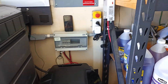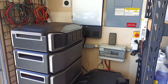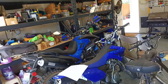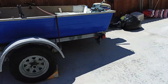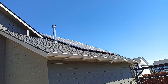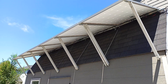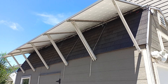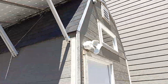The other question was how do I have these hooked up between multiple DPUs. I have my main array for four kilowatts — it has eight 475-watt panels up on the roof. That's my high voltage input for my first DPU. And here on the shed is my second DPU. I wired them all in series for high voltage because it charges better — the higher the voltage, the better. So they're all arranged in series. This is my input for my secondary DPU.